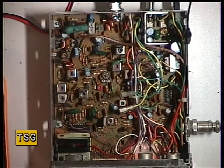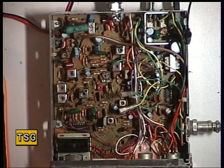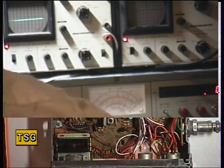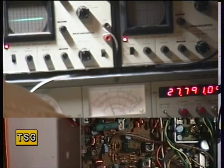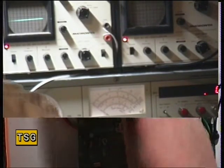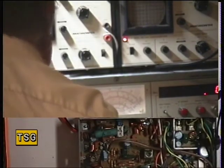I've got the test set on the other camera and I'll have that on the 30 watt range. We'll just switch that camera on for you to show you two things at once. I'm going to put the attenuator on — I think we'll get more accuracy, and the 10 decibel attenuator is on the backing conveniently on these sets.